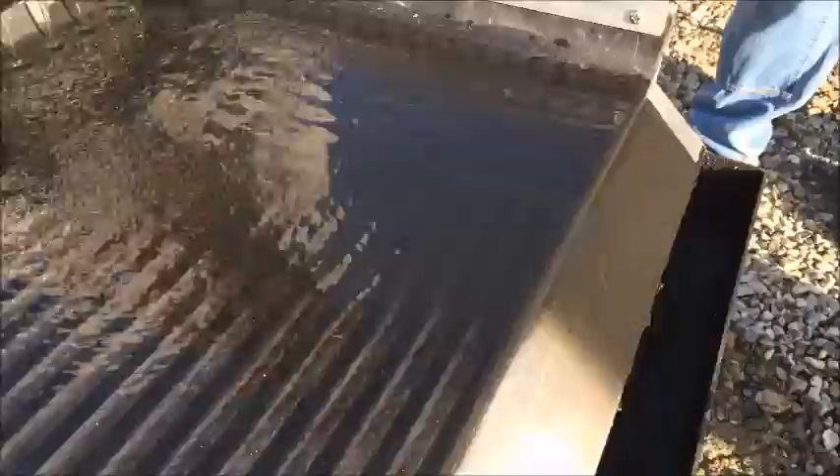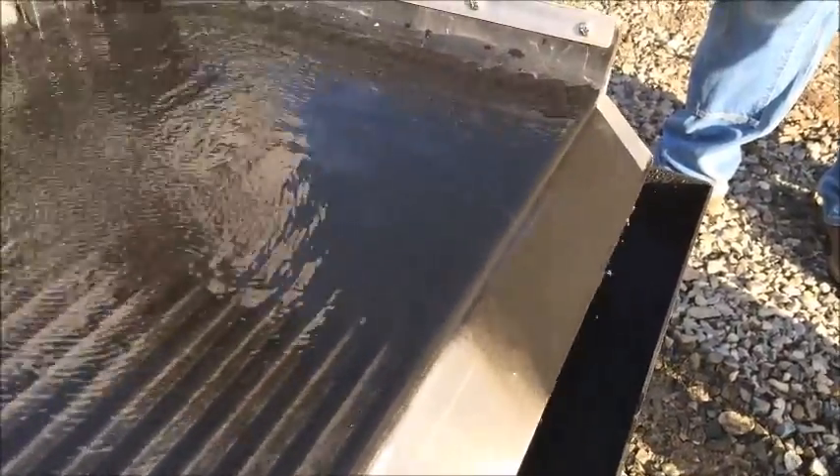Now the very fine ash material is working its way right down across the table into the tailings trough. Then we've got another bunch of material. Once that black smoky light stuff is gone, there's some darker, larger particles coming across and then some silvery shiny particles coming across. And then out of the top groove, we've got the gold coming across, and it will end up here under the water bar on the left hand side of the table.